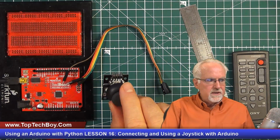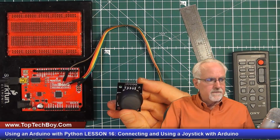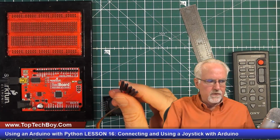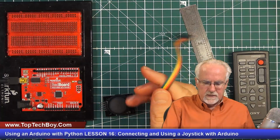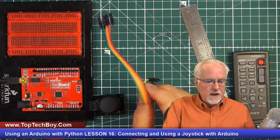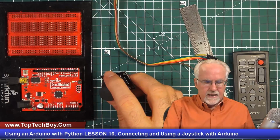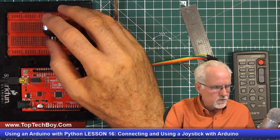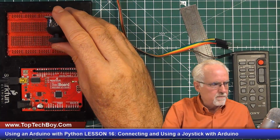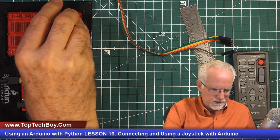Now you'll notice that the connectors on the joystick are male, and this is the case for most joysticks. They're male, so you need the female end on the wires, and then the other end needs to be male. If for some reason you don't have this female to male ribbon, what you can do in a pinch is plug the joystick into the board, and then bring the jumpers off the male to male. It's a little bit awkward, but that will actually work.